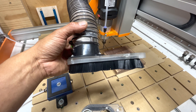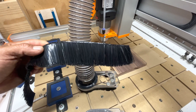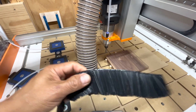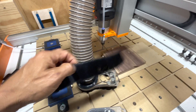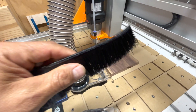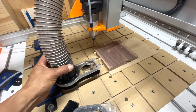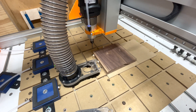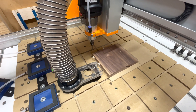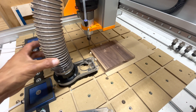The brush strip that's in there right now is a little small — it's a one inch strip. I have a two inch strip that I used in a previous test, but it's a little bit long. The problem with that is they're soft bristles, so when this boot floats, the bristles were starting to kind of bend towards the spindle because the space between the brushes and the spindle and the bit was a little too close, meaning the bristles would come into contact with the bit. I have an inch and a half length strip coming from another vendor, so we'll try that out and hopefully it'll work better. But this still does the job.